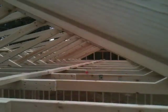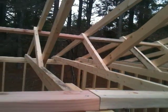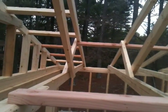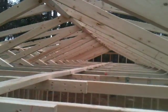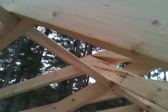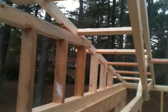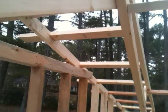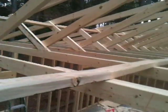Very sturdy. Normally with manufactured trusses you can't have them in a horizontal position whatsoever, which makes them a challenge to install because they have to be kept vertical. These, because of the overlaps, here's a sample of the overlaps. They were actually rather stout. There's a shot of the gable end with the lookouts. In any case, very proud of this.